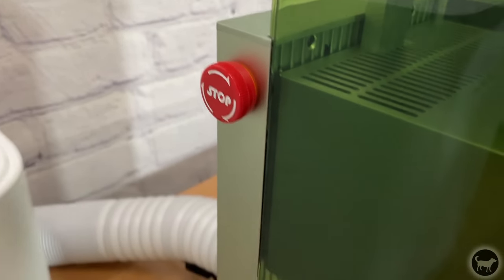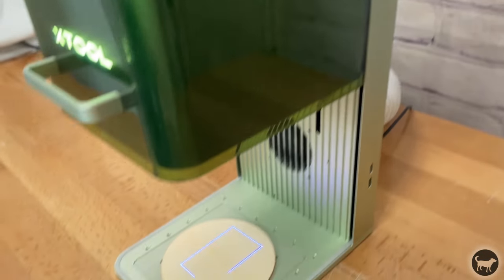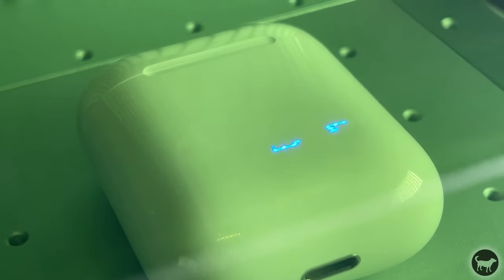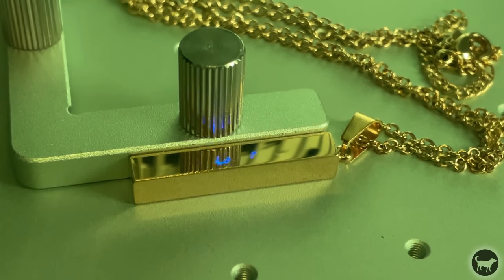On the left side of the machine is an emergency stop button, and on the right is the knob that controls the laser height. That knob is also what you push in to start a job sent from a PC or mobile app in Creative Space. Below that is a button that turns on the framing operation. The machine has two framing modes: a standard square outline giving a bounding box around your design, and an outline mode that shows the actual design shape on what you are engraving — almost essential when working with small jewelry and detailed pieces.